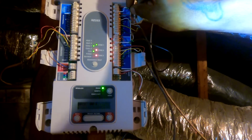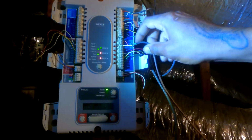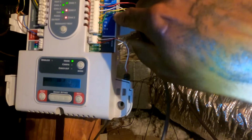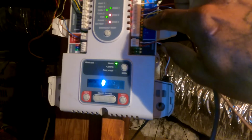They usually make two styles of these Honeywell dampers. A new kind, and a kind that's obsolete that a lot of people still have. But you see this says thermostat right here? That says thermostat. So we know, and you see it has about five wires on here. 1, 2, 3, 4, 5. So I know she got a thermostat going somewhere.